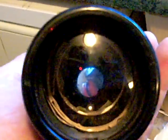Here we have, for instance, part of an old binocular set that I had, binoculars that didn't work very well. The front lens is 50 millimeters, it's a normal binocular lens, and I've used a prism which I've taped in at an angle and an old binocular eyepiece at the back. And the idea is I can put my eye up to this device here and I can see through my actual binocular scope distant objects. And that way, I don't have to strain my neck when I'm looking overhead.